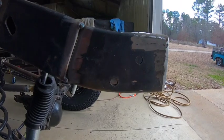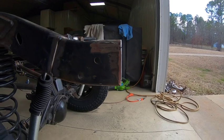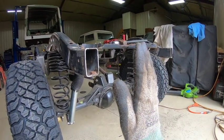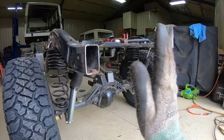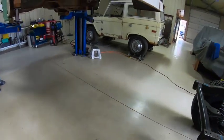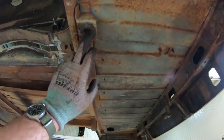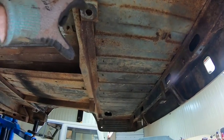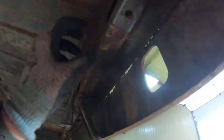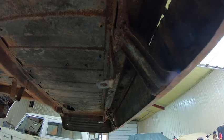I'm going to sit the body back down on it now and measure to see how much farther out I've got to come until I get to the back of the truck. We've got to pick up this body mount — you'll see it in a second — but that'll be on where the axle curve is coming down. This is the most rear body mount right there where the little cross member piece comes over, so the frame will end about right there.